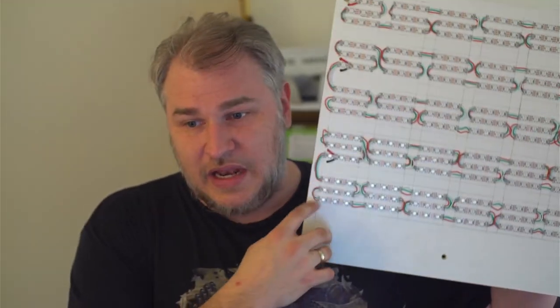So, after learning this, I learned that we needed some stronger batteries. So, we grabbed one of these, which is a 6.6 volt, 2200 milliamp hours, and it discharged at 25, essentially amp max, right? The math on this meant that each LED needed around 50 milliamps, and overall, the rough average was 13.5 amps that needed to come through here.